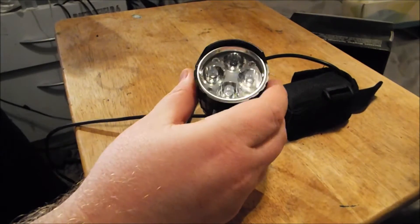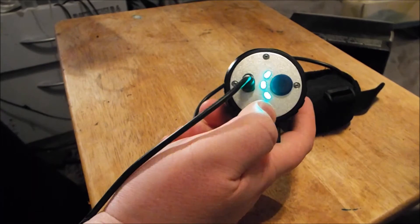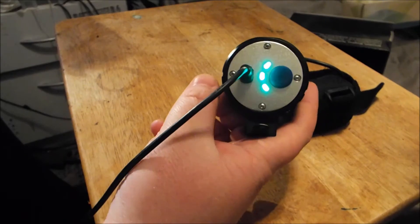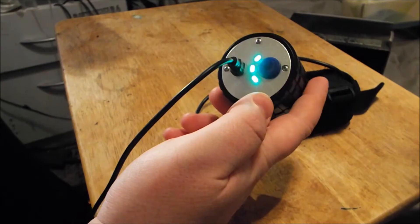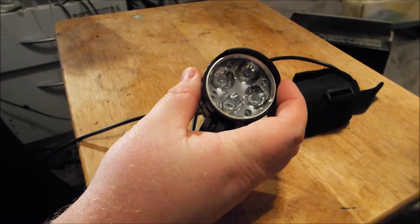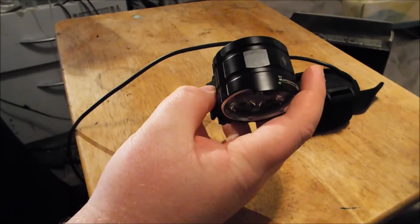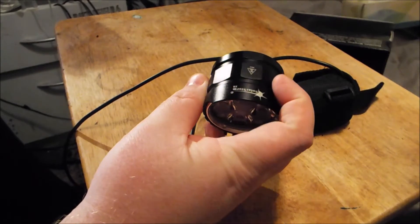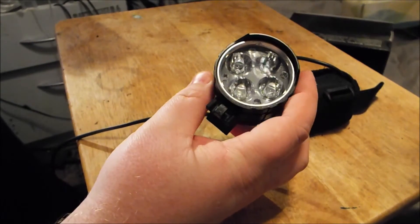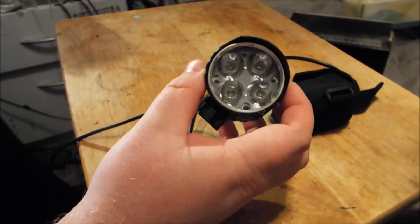It's got a battery monitoring system, which is pretty dodgy — I don't know exactly how it works. It's supposed to have overheating protection, but if you've got this mounted on your bike while riding, it's going to stay cool anyway because you'll have constant wind hitting it. The body is alloy — should be aircraft grade — but the anodizing looks pretty tacky, a bit dark. I think this is only grade 2 hard anodizing, not grade 3, that's why it's got this kind of smooth feel. For a cheaper light they've got to cut costs somewhere, and the optics probably cost them a bit.